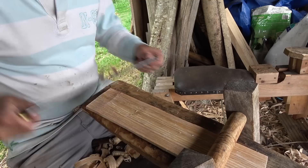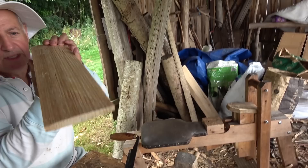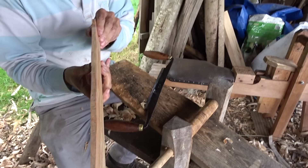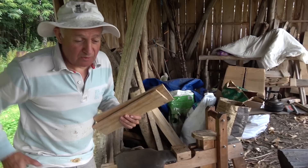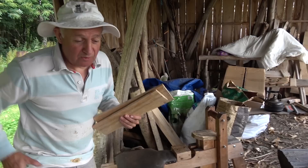There's the first shingle. If we look at that — a little bit of twist but not much. Fairly uniform in size, and that will lay perfectly flat on the roof. You can always trim them up afterwards if needed. I often go up with a small axe when laying and trim to suit. Is the idea also to stop water sitting in those grooves? Yes — a smooth surface stops water laying in any little cracks. It lays flatter. Well worth doing.